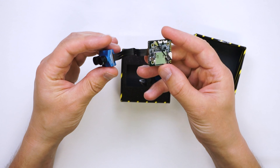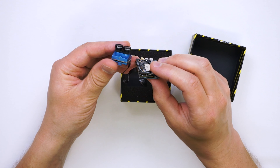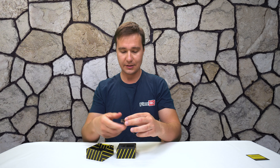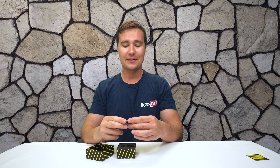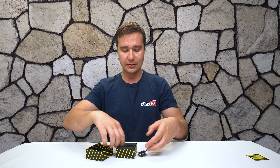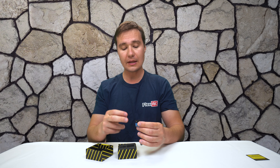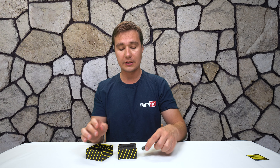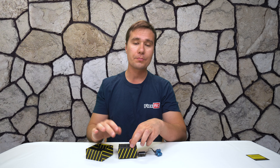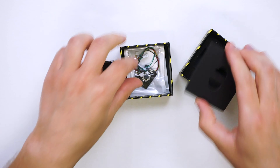It comes with a Wi-Fi module installed on the top. Here's the SD card slot, and this is the cable — it's not screwed in. We'll have to use some hardware to install it. You can see there are two lenses. The lens for DVR has a 2.8 aperture and it's supposed to have an anti-shaking mechanism — either optical or programmatic stabilization they implemented.